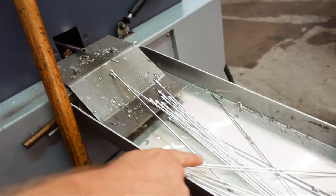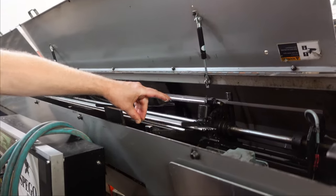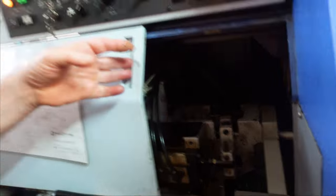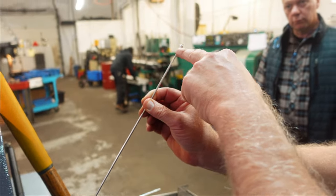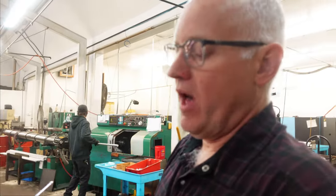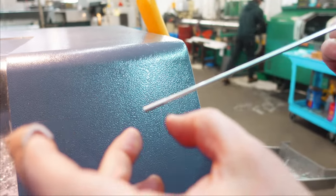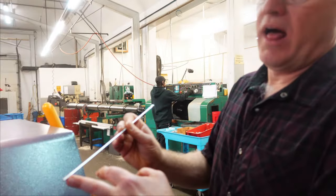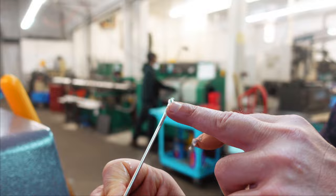You can see the spoke coming out of the machine here — all the machining is going on right there. These spokes start out as a 12-foot bar of aluminum and go into a special machine called a sliding headstock machine, designed to make parts that are really long and skinny. What's really special about how we make these spokes is on our system wheels we use a machined one-piece spoke — it doesn't have a separate nipple. The nipple is part of the spoke; it just drops through the rim and screws directly into the hub shell. What makes this better than regular wire spokes is our thread is oversized. On a wire spoke the thread would be way smaller — the thread is the smallest diameter, thus the most likely to break. We made the spoke a lot stronger by making the thread oversized, and by integrating the nipple you eliminate that connection point, making it much stronger.